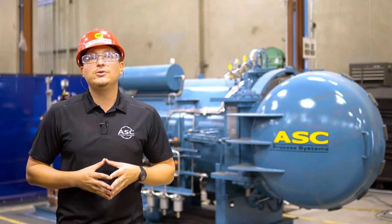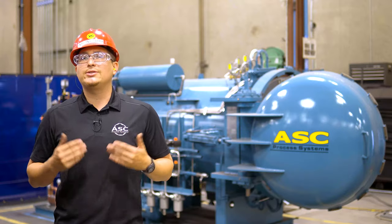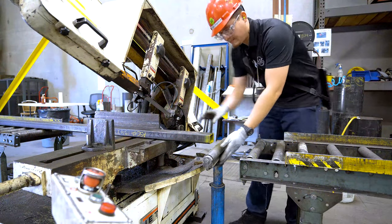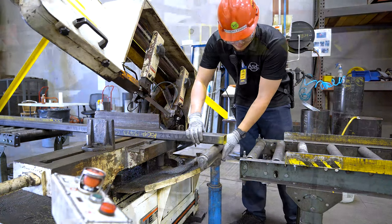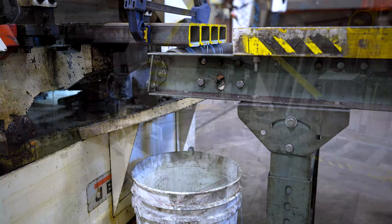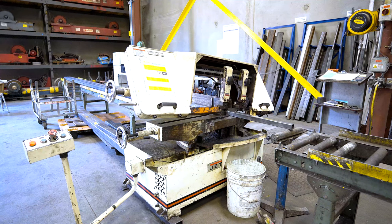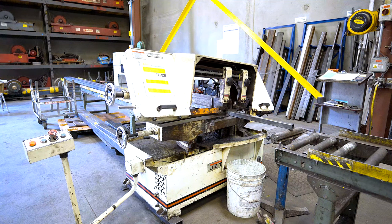Never use the conveyor to move multiple pieces that are not secured into a single bundle. Place a roller stand in front of the material if the cut is too small to reach the roller conveyor, and a bucket at the end of the material. This will help keep the material stable and ensure a clean cut, while also keeping the blade coolant fluid from spilling onto the ground.